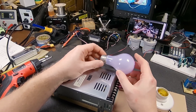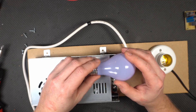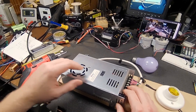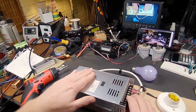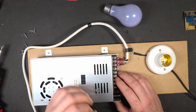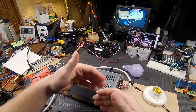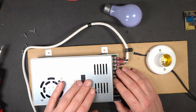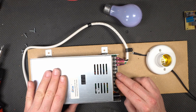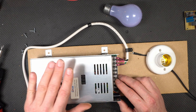The resistance does change with the temperature of the filament, so when you first power it up there's going to be some inrush current. You have to take that into account as well as what your charging current is going to be. This power supply — I'll put a link in the description below — is variable from 0 to 48 volts. It overshoots to about 51 volts, and I need 50.4 volts, so that works out really well. If you need more, you may sometimes have to put some of these in series. The only thing you have to look out for is to make sure they're isolated — no direct connection between any of the inputs and any of the outputs. That also includes capacitors, but that's a different video.